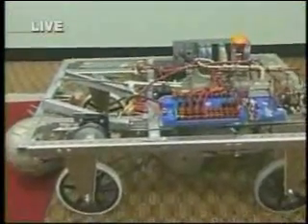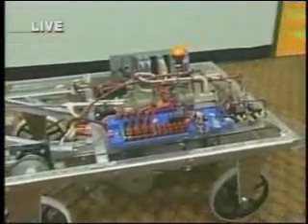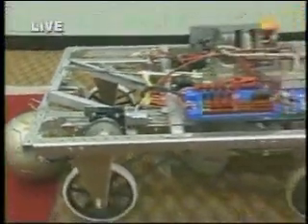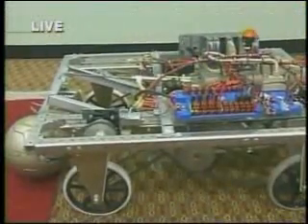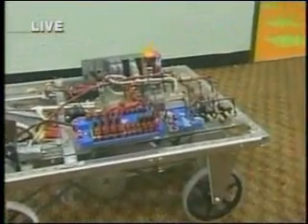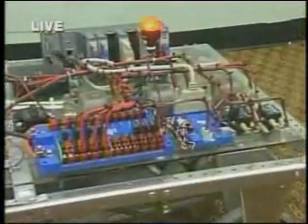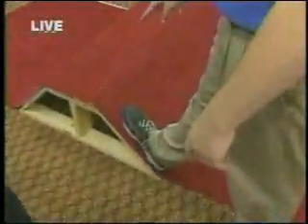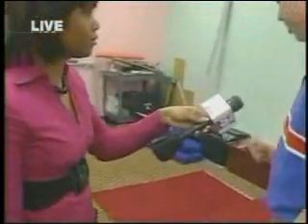So far, we haven't completed it yet. We still have to add the lifting mechanism, which has to lift at six feet off the ground. But right now, as you can see, the actuator works off compressed air and actuates with 60 pounds of force, hitting the ball with 60 pounds of force. When it back-actuates, it's making contact with the ball. The game requires us to hit the ball over bumps extended across the field, getting the ball to our teammates so they can put it into the goals in the corners of the field.